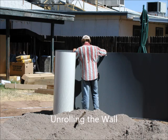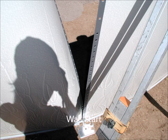This is me starting to unroll the sidewall, and notice where I start the wall, in the center of a foot plate. With any kind of luck, this is where you will end up. If not, take the wall out and reset the rail gap. You want the gap to be uniform at each foot plate and the pool to remain round.